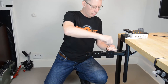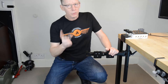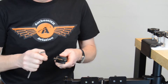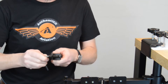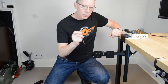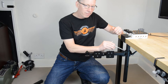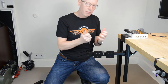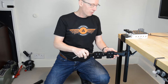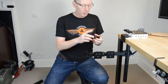There's an optional piece called the arm lock, which you may or may not need. The jaws are sheet steel and you can really tighten down with the allen key to grip the next pole section very securely. However, there's an allen key bolt underneath to tighten onto this end, but this is cast aluminium and however much you tighten it, it just doesn't fix rigid. To get this one rock solid, I've made the arm lock.